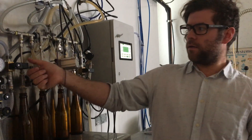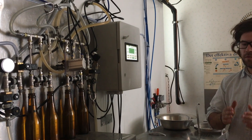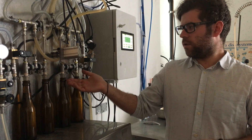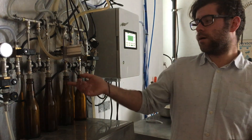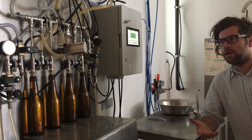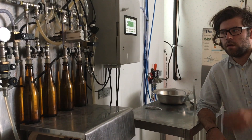And that's the dried hops. All the valves here - magnetic valves - are controlled by different time settings. When we start filling the beer we also open the exit valve. And when the beer is coming up to the top of the bottle, we cut off the beer supply and keep the exit valve open.